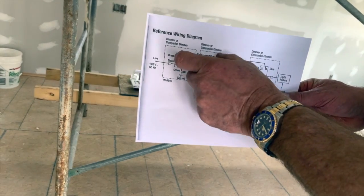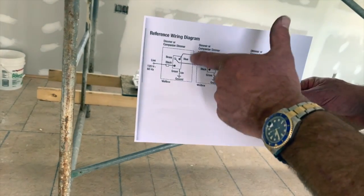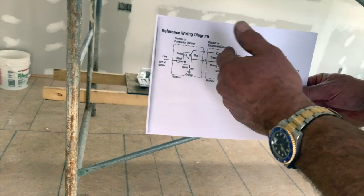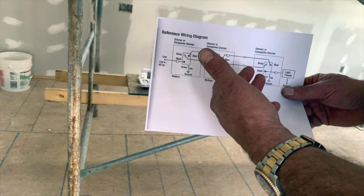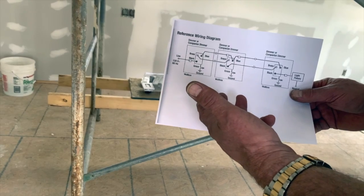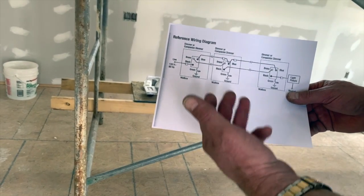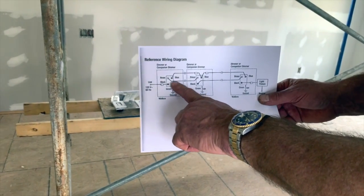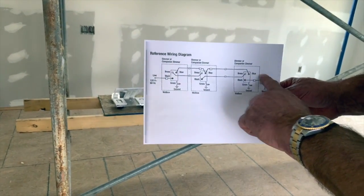You can see there's more wire between the switches than at the ends. That's where you're using three-stranded wire, commonly called 14/3. It really has four wires including the ground. Nonetheless, it's more wires between the switches than at the ends.